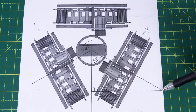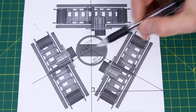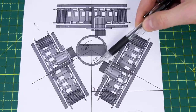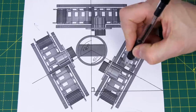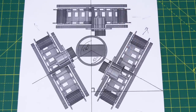That's pretty easy to work out because we can just draw a right angle triangle with one side being where the track would be if it were straight and the other being where it actually is, which is rotated 60 degrees. Then we can just use trigonometry to work out the ratio — in this case it's cosine of 60 degrees which is 0.5, so this line is half the length of this one. That means the straight track needs to run 50% faster than the ones at an angle. The angle of these wheels causes the robot to twist in its vertical yaw axis, so we need to run the straight track faster to untwist it.